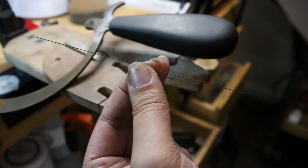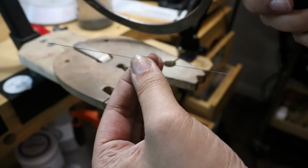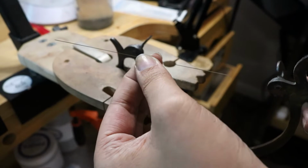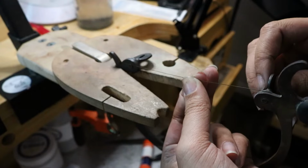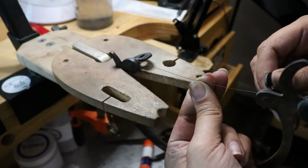When you're ready to feed the blade into the saw itself, you need a hard surface. You can either use your bench, or I use my bench pin, and I press it between the bench pin and my shoulder or my sternum. Once it's stable, you want to go ahead and lightly place the blade with the teeth facing up into the 2 slots. Tighten one side down.